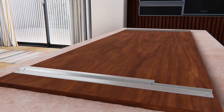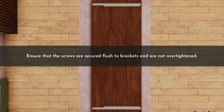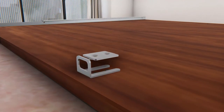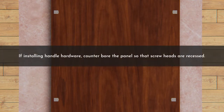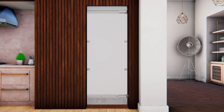Install the top and bottom panel mounting brackets on the overlay panel using six number-six Phillips head screws. While mounting the brackets, the cutout on the bracket should be on the inside and the flanges on the bracket should face toward each other. Ensure that the screws are secured flush to the brackets and are not over-tightened. Now install the center mounting bracket assemblies in four places on the overlay panel with two number-six Phillips head screws. After installing the top, bottom, and center mounting brackets, remove the L-shaped bracket. If installing handle hardware, counter-bore the panel so that the screw heads are recessed. Assemble the top center bracket and secure with two Phillips head screws.